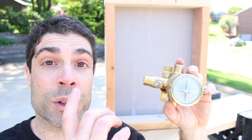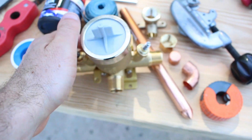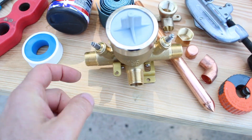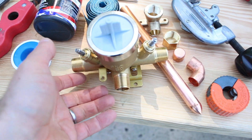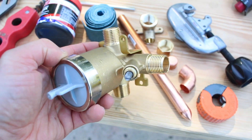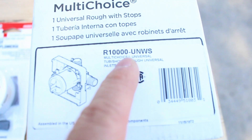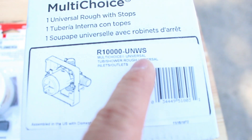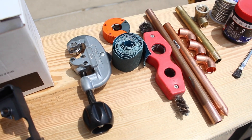We're going to give you a ton of different tips on how to use this with copper, and share the different tools and materials that make this much easier to install in your bathroom. Right off the bat, this is the Multi-Choice Roughin Valve by Delta. You have four different ports: your hot, your cold, your stub-out port for your tub, and your top port that goes to the shower head. The model number is R-10000-UNWS, which basically means it's universal with stops. You get a plaster guard with it, which we'll go over.